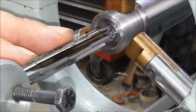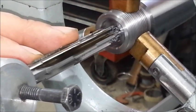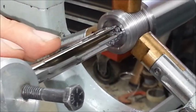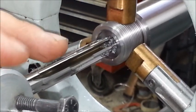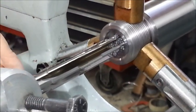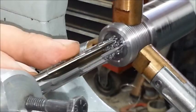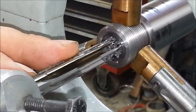I keep my fingers on the reamer so I can feel if there's any vibration, which generally turns into chatter, and also to see if the reamer moves around. What that tells me is that the bore is curved or we're into a new section that isn't concentric to the threads, and then we make some adjustments to get everything back in straight. But with good barrels and good equipment, that's usually not a problem.